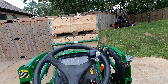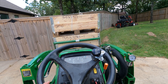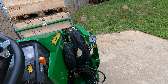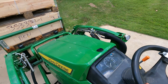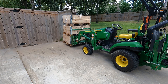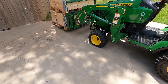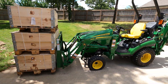Getting it level at my weighing height. Reading is 2250 PSI. This has the 1.75-inch bore cylinders on it, set to 3000 PSI. All four wheels are on the ground — you can see some pretty good tire squat there — but the load is off the ground. So that's 1335 pounds at 2000 PSI delta.